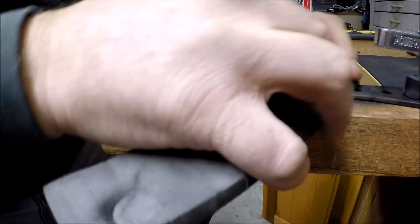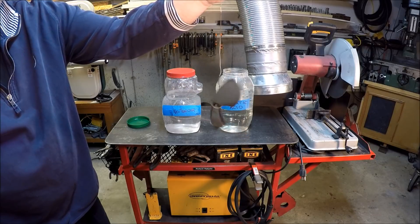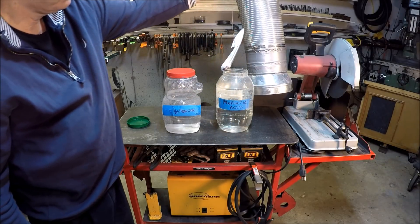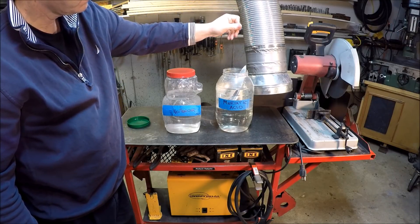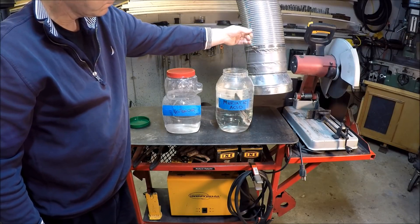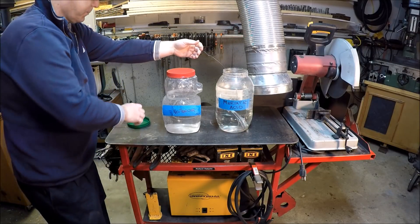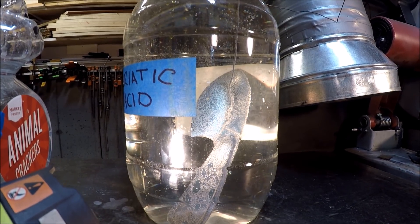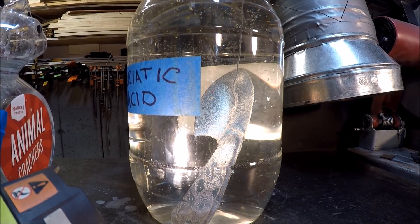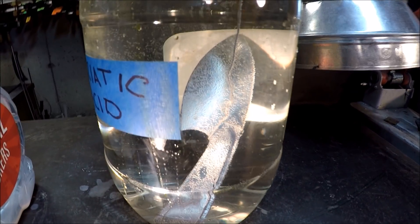Around 400 grit I thought was the right level for the etching. Here we go — we're ready to etch the blade in muriatic acid, undiluted, straight muriatic acid for this blade. It was a little cold in the shop so I knew it would take a bit longer. If you heat the muriatic acid in a warm room it works better, but you really need to do this in a well-ventilated area. You can see the close-up of the blade and the muriatic acid working against the carbon steel — little bubbles, pretty cool watching it do its work.